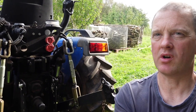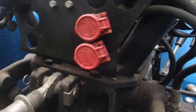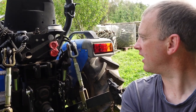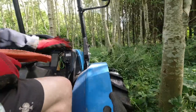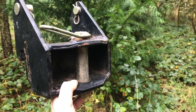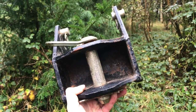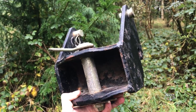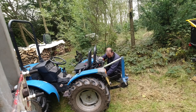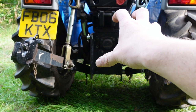Standard spec on this one has got spool valves — a double acting spool valve, those two things there. It can power something that's got to push both ways, so backwards and forwards, like a ramp. There is also a tow hitch that goes on here — a special metal carriage fits into these pins and allows you to put a ball hitch or trailer hitch on so you can tow a trailer. I've got an A-frame that connects to the three point linkage with its own ball hitch, which I find slightly better than that arrangement as it gets a little too close to the PTO.